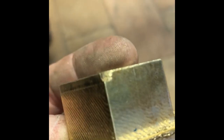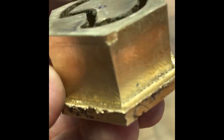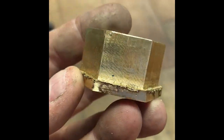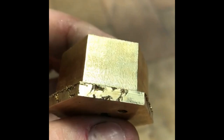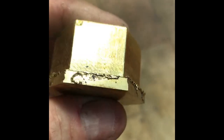The side finishes — that's why I've done it. See that defect at the top? That's why I've done it so deep, so that I can get rid of stuff like that. That's a defect. And any inclusions in this, or holes in the casting on the side — of which I can't see any, which is great, because it means the fuel won't leak out.